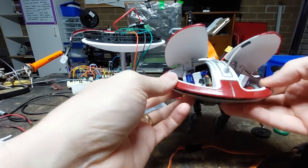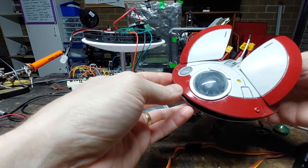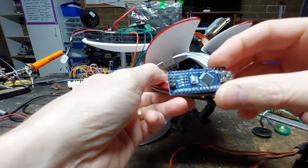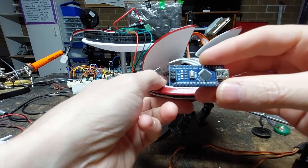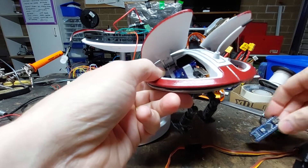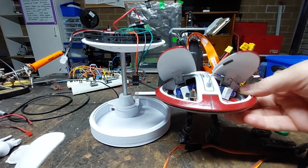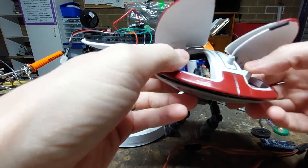What I've done with this one was pretty quick to get it done for an event. Not much changed from the version 1 files. This is battery contained within the body. An Arduino Nano — if you don't know what they are, this is a little microcontroller. You can program it via a USB port into your computer with all free software. There's a couple of Christmas tree leftover blue LEDs which I cut off old Christmas trees, and two hobby servos — SG90 micro servos.